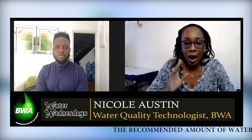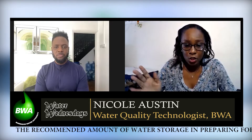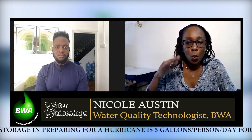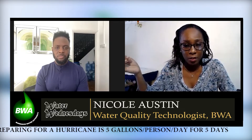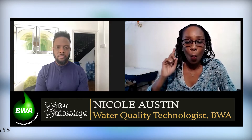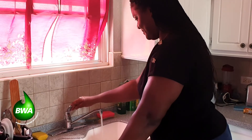What is very important is that after the 24 hours is finished, you want to make sure that the lines leaving that tank are also disinfected. You will have a very disinfected system of water within this tank, and now you want to make sure that the lines going into your home — every kitchen sink, the bathroom, and the face basin — those lines leading to those pipes and faucets are also disinfected and sanitized. So after the 24 hours, you open up every pipe that is fed by this tank. You make sure you walk around and allow that water to come out through that line, and you make sure you smell the bleach smell at each tap. Each tap that is serviced, you want to make sure it's getting all the way through the house from this tank, with the supply from the sanitized tank.